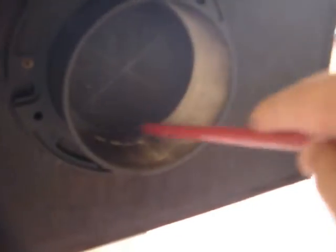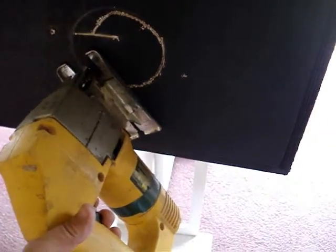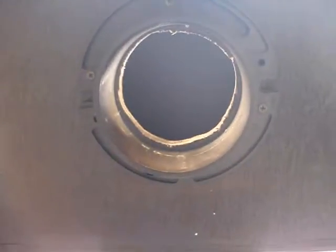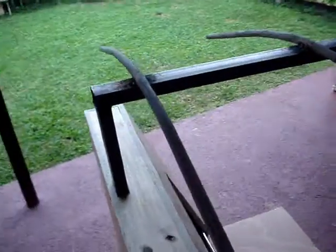I separated the battery box with a divider right at the bottom of where the main box lid comes down. Here I'm installing the 4-inch flange — I cut the hole out, and this is where I'll install the fan to ventilate the battery box. I plan on using a deep cycle 12-volt battery to help extend the life of the system if it loses power.